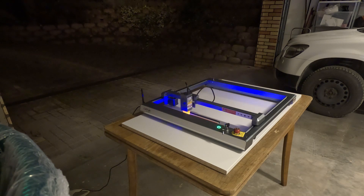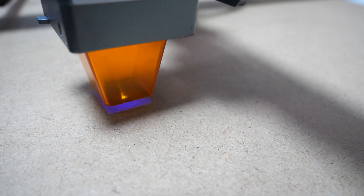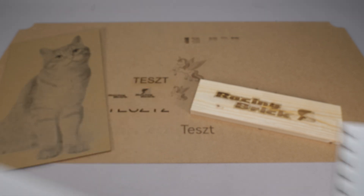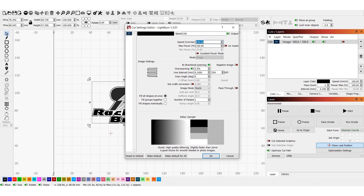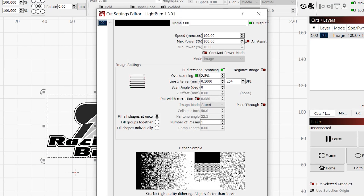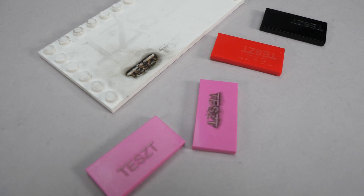I decided to only engrave a few pieces of LEGO. The machine was placed in a garage with the door open, and the operation was executed remotely through WiFi with no person around the machine. Positioning with such small pieces is a challenge — luckily there's a fire button in the app that lets you use the laser as a literal laser pointer with the energy level dialed down to minimum. It's also possible to visualize the frame of the print for positioning. My first tests were done on big white tiles and got this result with my logo — it looks cool but is barely visible, done at maximum power and 100mm per second. Slowing the engraving down produced results with more impact.